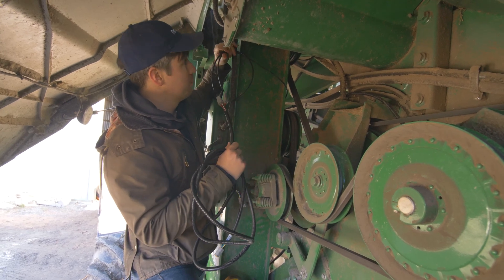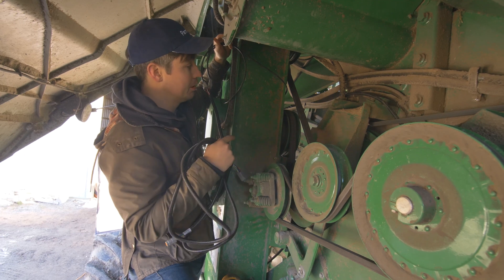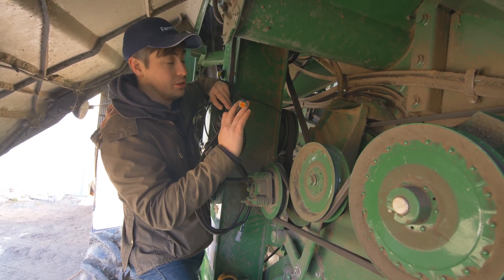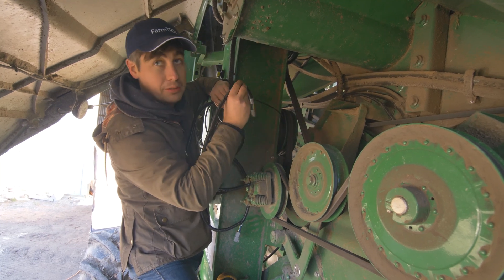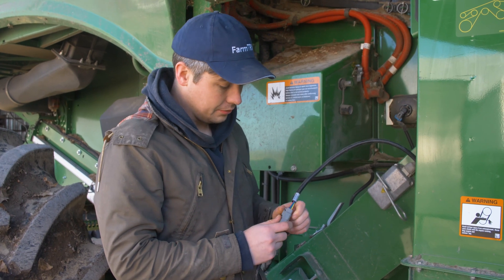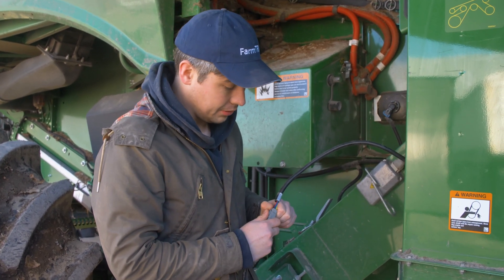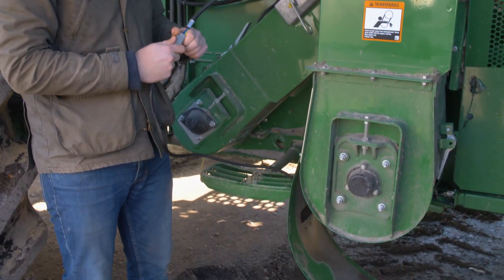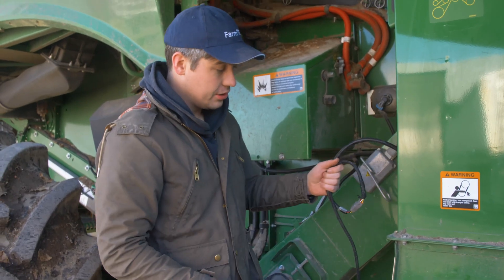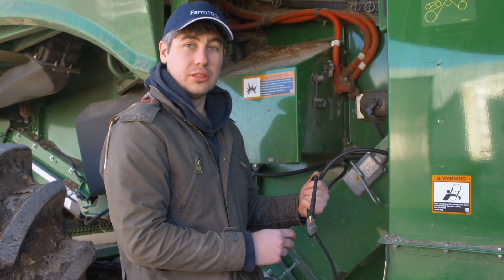On this S770, we're going to run the wiring to match this harness here and stay away from these moving belts. We've got this pigtail here on the interconnect harness — it's for the moisture sensor, so we're going to tuck it down the back and down to the bottom of the elevator. When you bring the interconnect harness down to the bottom of the elevator, you'll be able to simply plug in the wiring harness that comes off the moisture sensor, which we've now mounted in the door here. Make sure to take up any extra slack in the harness so you don't have it laying around potentially getting caught on things.